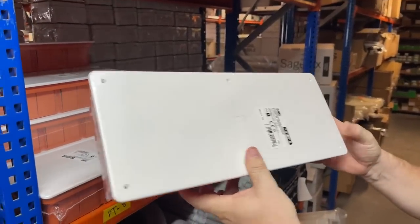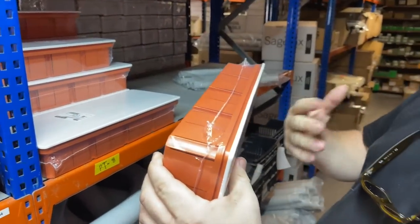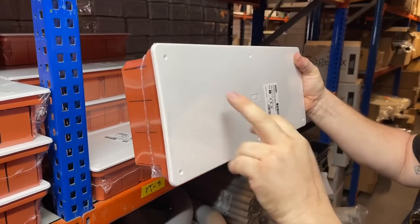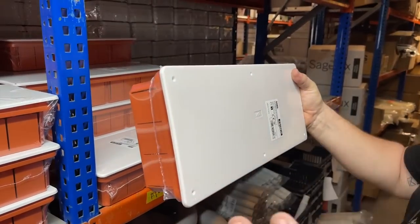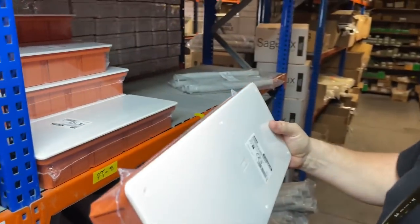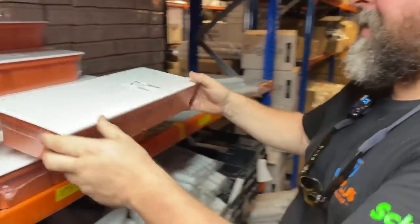Okay, so underneath the consumer unit, straight away you're into a box. Straight away you've got something like this, so you would feed with 25 mil tubes or 32 mil tubes, depending on how many circuits that you've got, and then distribute out with the 20, 25 mil, 30 mil tube, 32 mil tube, and they get connected in here with WAGOs or connectors, and distribute out from these boxes to all the circuits within the vicinity. Okay, are you allowed to make connections in the distribution board, or does it happen? You are, yeah, but it's not a good idea to have connections inside the consumer unit.